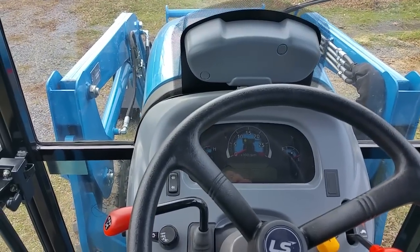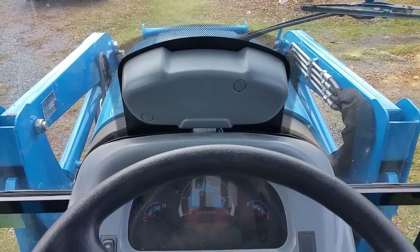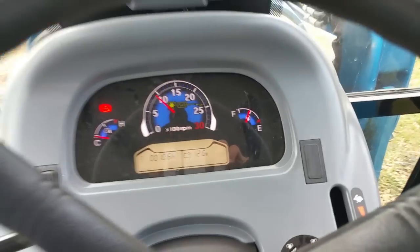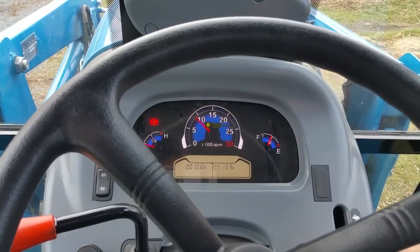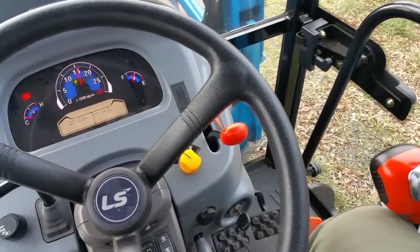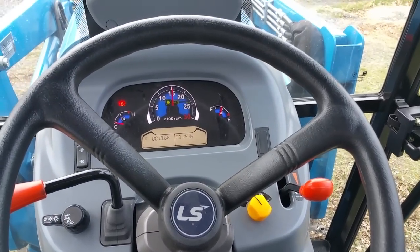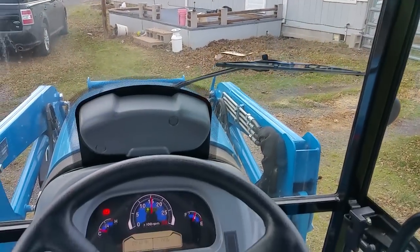Anyway, I just wanted to leave you with this walk around of my tractor. What I'll do is start it up and let you hear what it sounds like inside here. Wait for my glow plug light to go out. It is relatively quiet in the cab. They tell you to warm it up — run it at two to three minutes at 1500 RPM before you start running the machine. And this is a drive-by-wire engine, so this foot pedal and hand throttle are not cable-actuated — there's no actual mechanical throttle on this. It just goes to the computer and the computer controls the engine. So this is not a mechanical diesel — it's fully electronic. Yeah, I really like this. Thanks for watching.